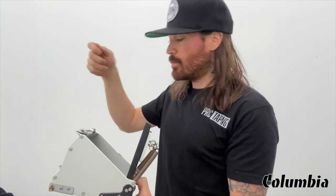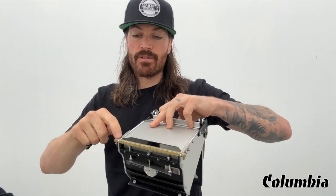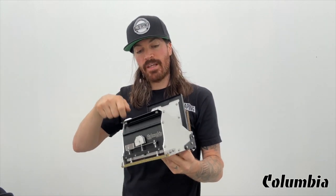You're going to pull this gasket out. You're going to take all the mud that's left inside of here, reuse that, and put it in your bucket. You're going to clean this out with clean water. Make sure it's always clean, and you're getting in every little spot here, the edge of the blades, where the wheels are, even where these springs are. Take a brush and clean that all out.